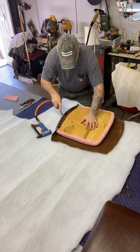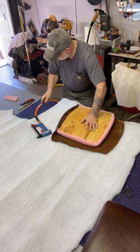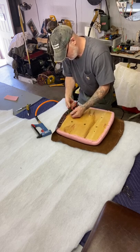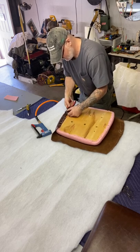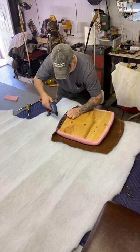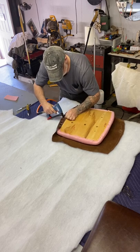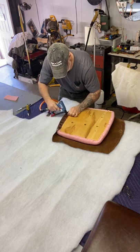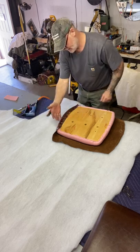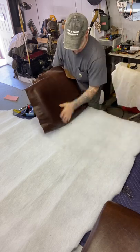And if you have to, you can do it right away. You can pull those staples in the middle, grab your pliers, give them a slow rock. And then start in the middle again, and split the difference every time. And then everything's flat. Then I like to come back through. Don't trim this until you're done. Okay, so it's glued down, so it ain't gonna move.